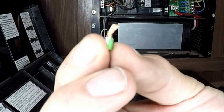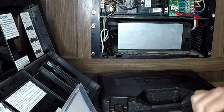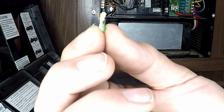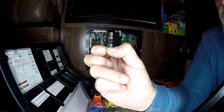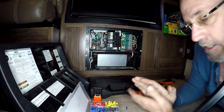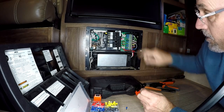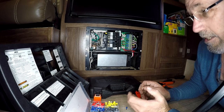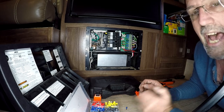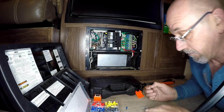You're not getting 100% contact with the block. Here's another one — again it's not cut straight and it is getting pinched. That material getting pinched like that is going to prevent the screw from fully grabbing the copper wires and compressing them against the lug. You're going to have resistance there, and resistance equals heat, heat equals oxidization, and oxidization equals no bueno — it's bad.